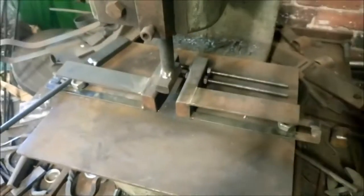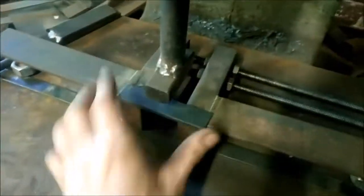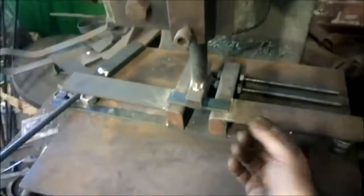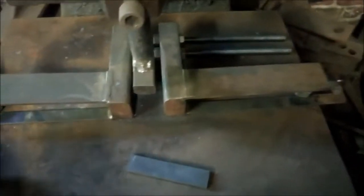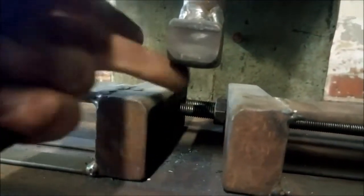On the fly press version: the material comes out hot from the fire or gas forge, you put it on the jig, pull the arm round — that sends it down and squishes it up into a U shape. Then I get the jig out of the way and form the collar around the mandrel with this tool, which I've put some radiused edges on so it doesn't bite in.